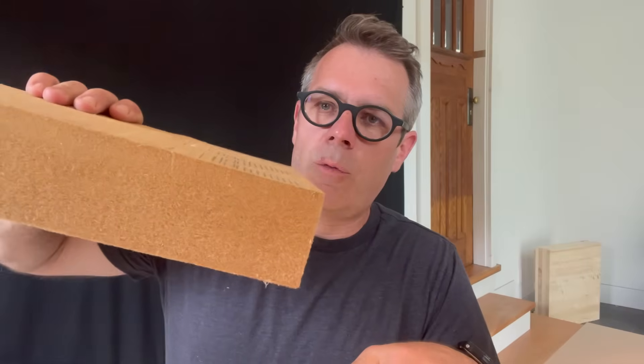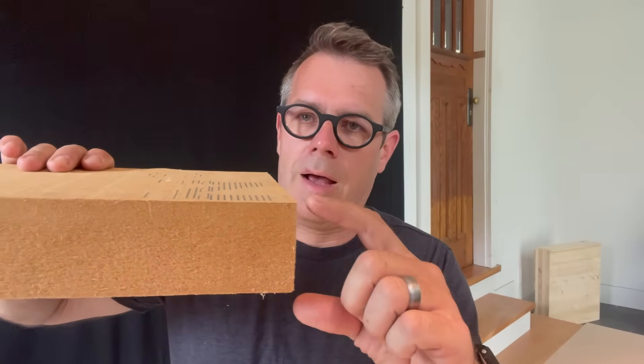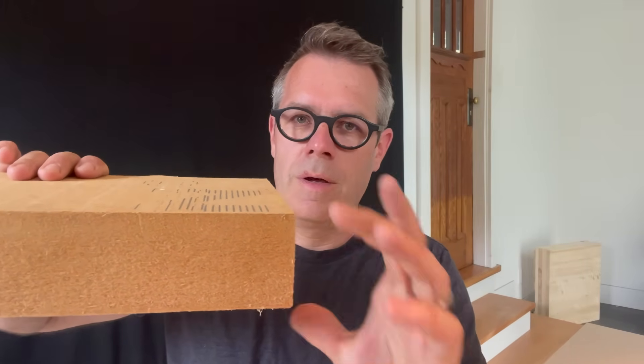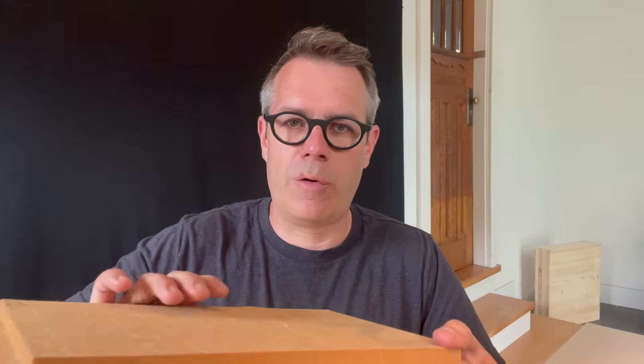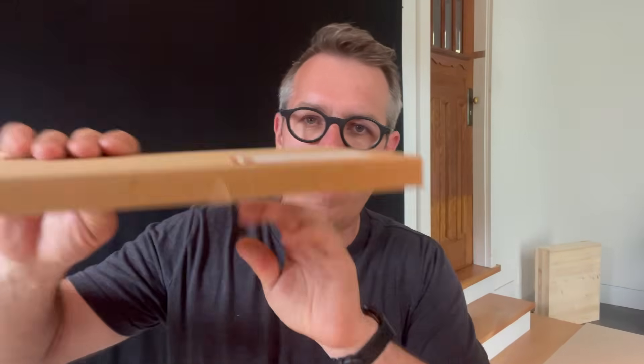Here's a sample of that — this is 60mm wood fiber board that acts as insulation. It breaks thermal bridging and it's vapor open, which is very important. I'll get into those details in a later episode on the wall buildup.